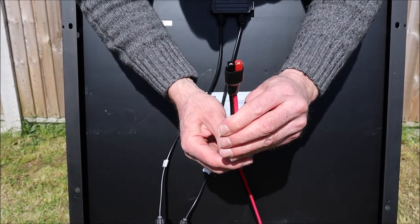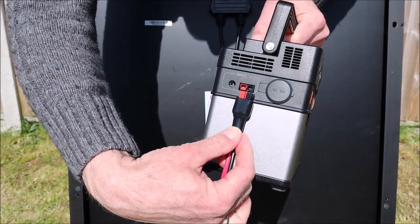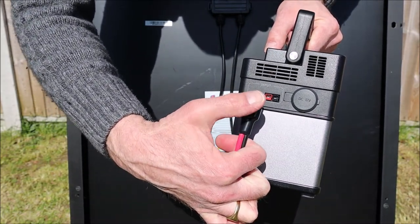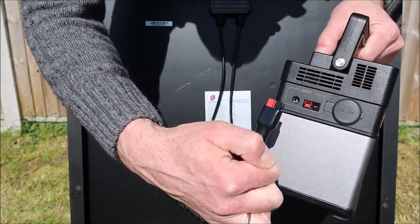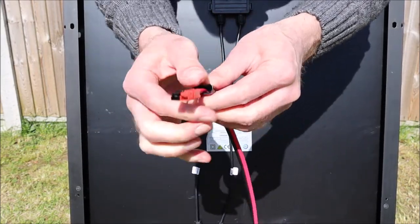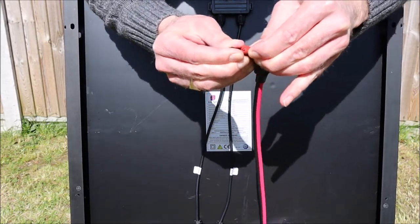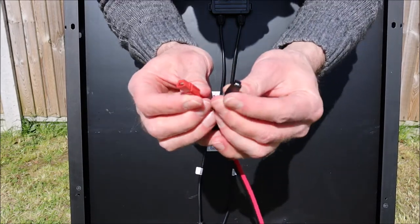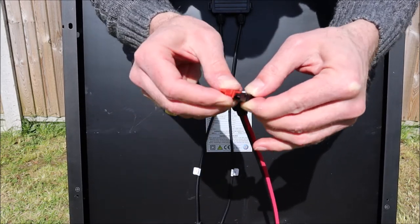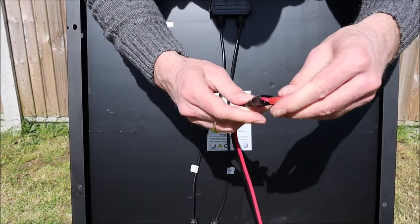I need to flip these around, so let me check it out. As expected, if I were to plug it in the way it is at the moment, I'd actually be cross-wiring it, because the red on here is the negative and the black is positive. So I need to switch these two around, which is fairly easy to do. I'll take this out as I did before — that's nice and tight. So again, we slide them up because they've got little grooves on them — that's what Anderson ports do — then flip them around, slide that back on there. There we have it — it's slid on perfectly. Just put the protective cover back over and it's ready to test in the solar generator.